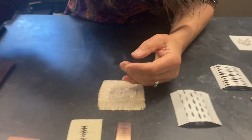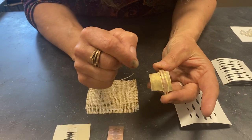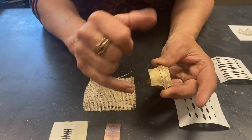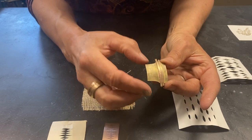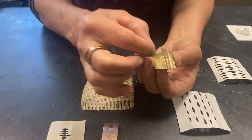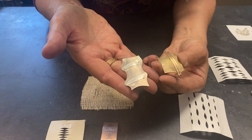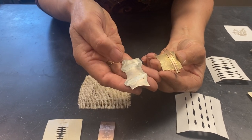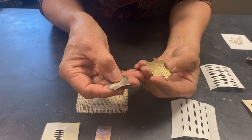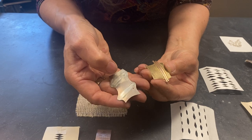Another interesting thing I did years ago: I had a production line of jewelry where I took a one-inch square and soldered two pieces of copper wire on it, then rolled it through the rolling mill until it became flat and flush. You can see the elongation and change that took place — this metal is much thicker, so it grows much faster. You get really beautiful organic shapes, and I also call this a fake inlay. You solder the wire down, put it through the rolling mill, it stretches. If you do it carefully and anneal it often enough, you get a nice smooth flat surface that looks like inlay.